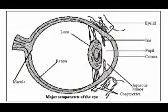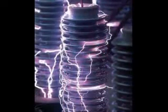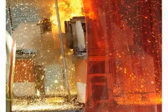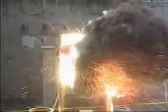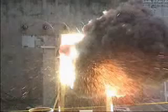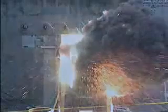They create very bright ultraviolet light that burns the retina of the eye. Sometimes arcs create low resistive paths for electricity to flow between electrical conductors such as wire. This can create an explosion of superheated gas called an arc blast. An arc blast can be a powerful and very hot explosion capable of killing or injuring anyone nearby. Here is a clip of an arc blast created on purpose by shorting some high current 480 volt AC wires.